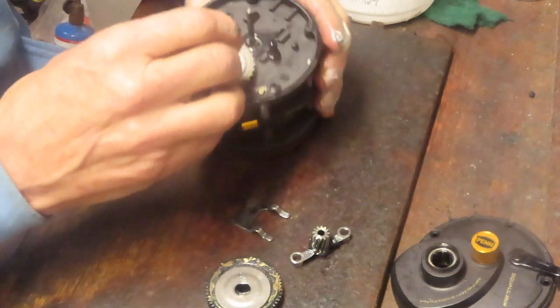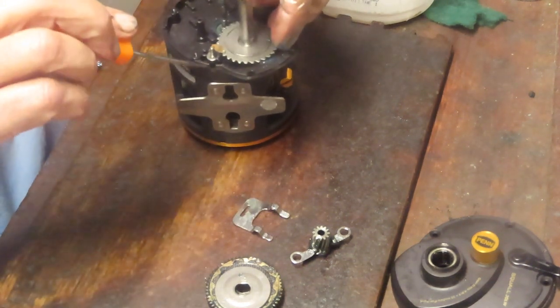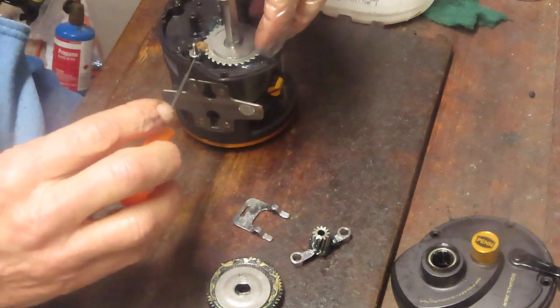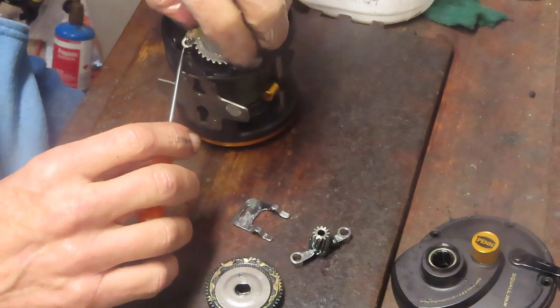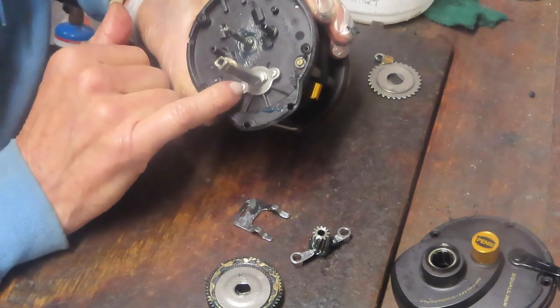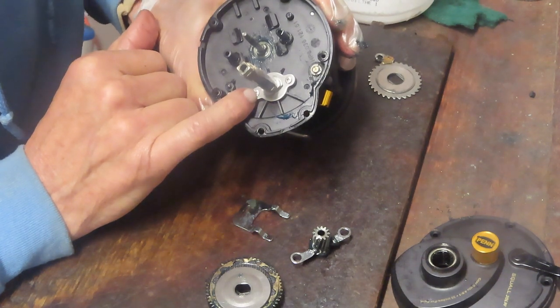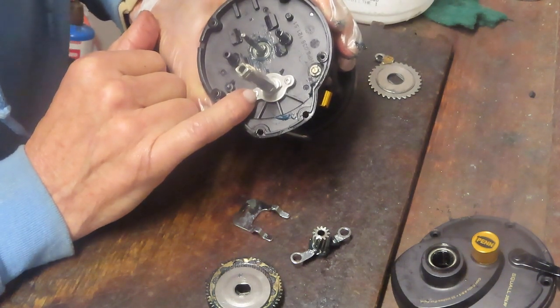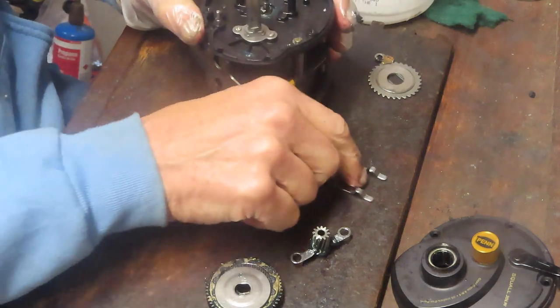This whole thing should lift up. You may need an assist to keep it equal — it's pretty close tolerances here. Just pull it up. You don't have to keep them together, but know that they go together to form that piece. I wanted to do that because under here I'm going to check the schematic — but under here should be a ball bearing. There's a ball bearing under there and you want to get to it as part of your maintenance.